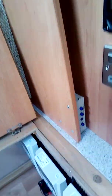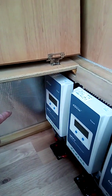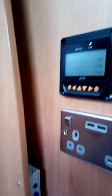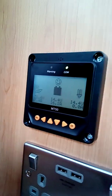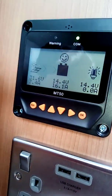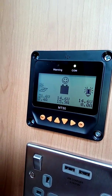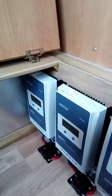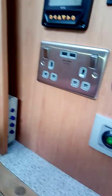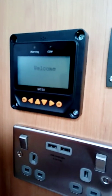I'd come back here and check on circuit A — that's circuit A we're looking at in the corner — and just make sure I've got that arrow, which will tell me I'm actually getting power from the roof. Then I'd do it with circuit B: close it there, go up to the cupboard, close that one, change it to B here, and check I've got that arrow.